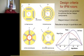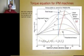And so to effectively administer D and Q axis current control, you determine where the rotor is by measuring these inductances, because there should be quite a big difference in the value of the inductance in quadrature axis versus direct axis. So if you can measure the inductances seen by the windings, then you know where the rotor is, and you know where to gate the transistor. So that's what this shows you, where those axes are.